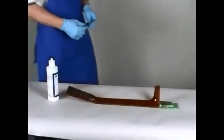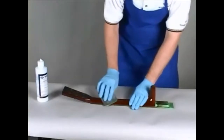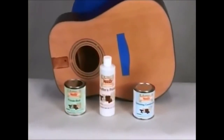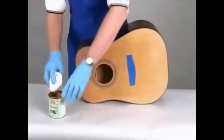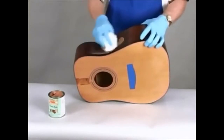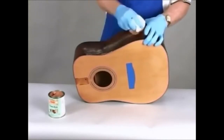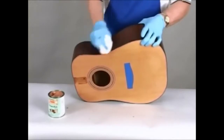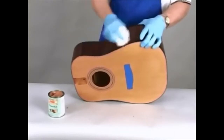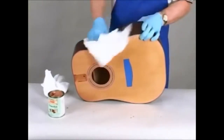Now we'll start the process of sanding the neck. We will not use a sanding block in this case. After sanding, we'll use rubbing compounds to take the finish the rest of the way to a high gloss. Begin applying it with a soft cloth balled up in the palm of your hand, spreading it over the surface to be rubbed. It's better to rub in small areas than rubbing the whole side, back, or soundboard at once. After spreading, rub in a circular motion and then with the grain.